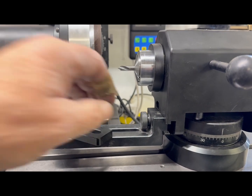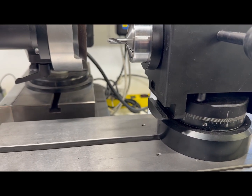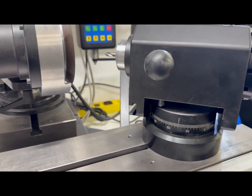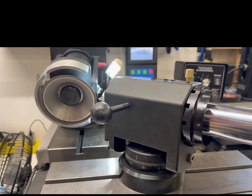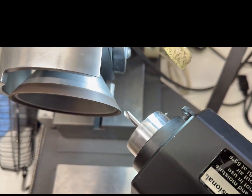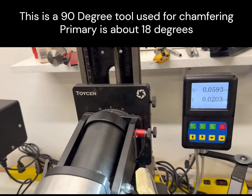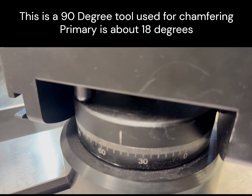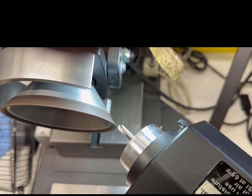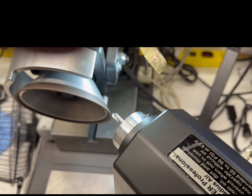We'll take the shelf off and rotate the spindle to 45 degrees. Sharpening hard spot drills are expensive — it's nice to be able to touch them up, especially if using them as chamfer tools. In this case we have the motor set at about 20 degrees for the primary. We've set the height, this is at 45 degrees, and just come across the end. Let's take a little bit more here.